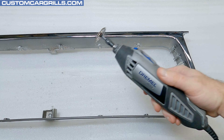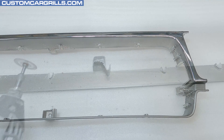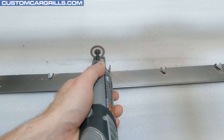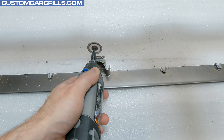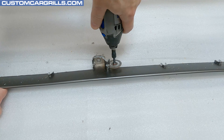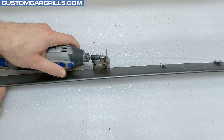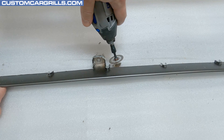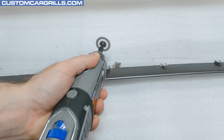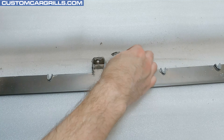Now's the time to change tools — I'm going to grab my Dremel and equip their number 543 cutting and shaping wheel. This is where a bit of patience and attention to detail is needed. The end goal here is to keep the full thickness of the back of the tab while trimming off the surrounding plastic that covers the front. This takes multiple angles of approach and a steady hand to accurately get the correct cuts needed to make this look right. It's important not to cut the tab off, so just be mindful of where the cutting wheel is at all times.